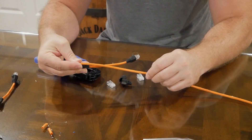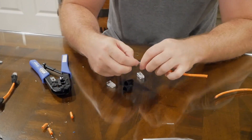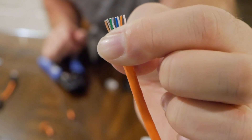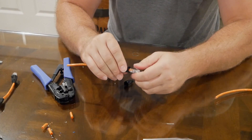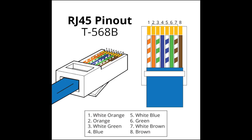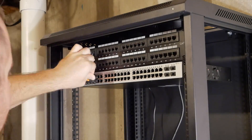There are much better videos out there on how to make these cables, but I'll quickly go over how I made mine. After making a template cable, I cut the new cable to the correct length and stripped about one inch of the jacket off one end. Next is to separate all the wires, configure them in the correct pattern, and use the tool to trim them to the same length. Then push the wires into an RJ45 termination pin out and use the crimp tool to crimp everything in place. Last, slide the boot over the terminated end — be sure to put the other boot on before going to the opposite end and terminating it as well. Here's a quick reference picture of the configuration I used for all my wiring. These little guys took forever to make, but here all of them are ready to be attached. To satisfy my OCD, I matched the port numbers on both the patch and switch panel.